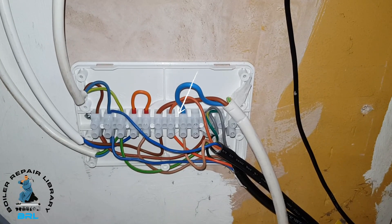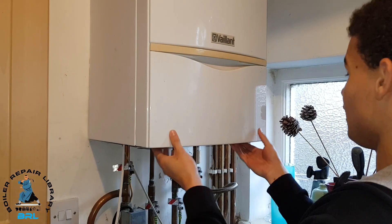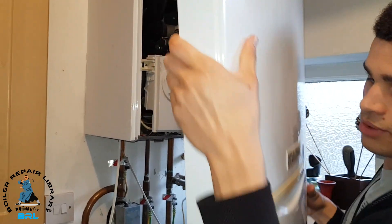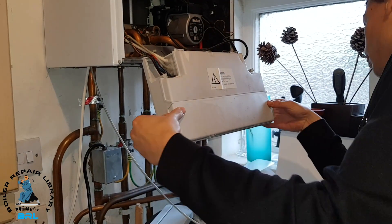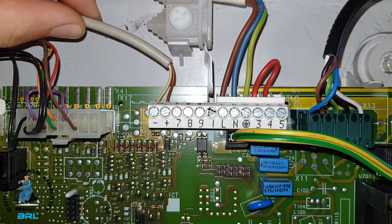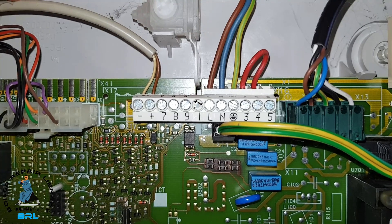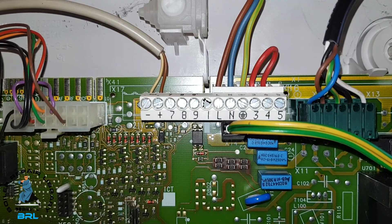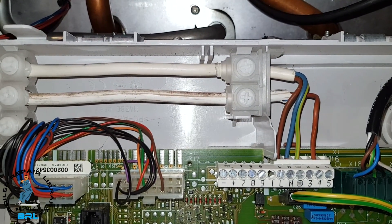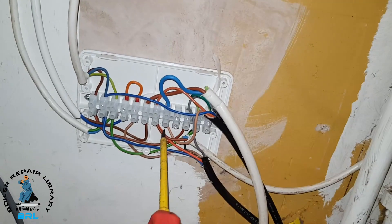The final piece of the puzzle is connecting the orange switch lives to the boiler. We're going to get the boiler case off — there are just two clips which push up like so. Undo the clips on the side and get this cover off to access the PCB. We're going to get rid of the cable from the VRC 400, the old controller. We'll remove the link on terminals three and four and put a connection on terminal four, running the cable back to the orange switch live for the pump and boiler. We've run our new cable on terminal four and the other side connects to our orange switch live in the wiring center. This is the cable coming back from the boiler — as you can see we've connected it here.